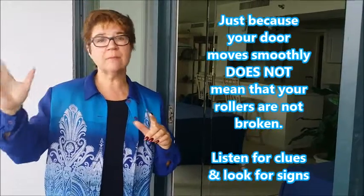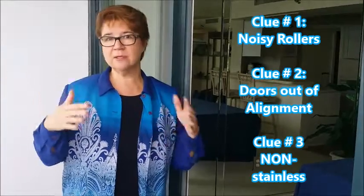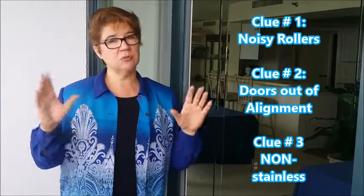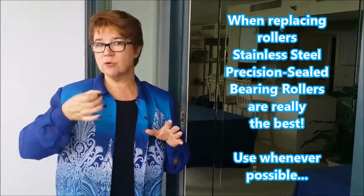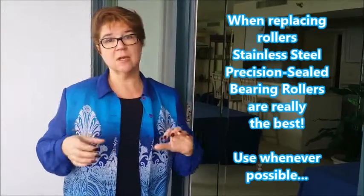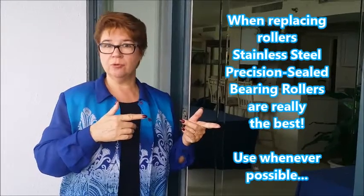And that's extremely helpful when you're dealing with salt conditions, sand, and other kinds of dirt, fecal hair, pet dirt, things like that. Sealed bearings do not require lubrication. So it's very, very useful. And then of course the housing itself is made out of aluminum, and then the roller itself is stainless. So we're really looking at a good quality roller to make these doors roll beautifully.